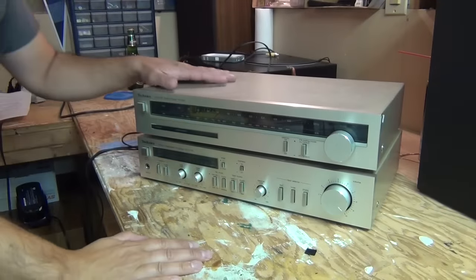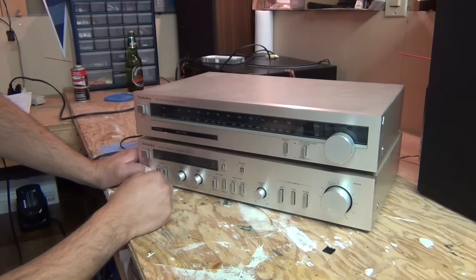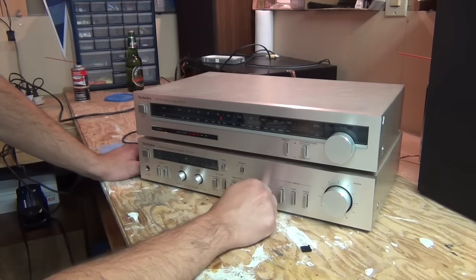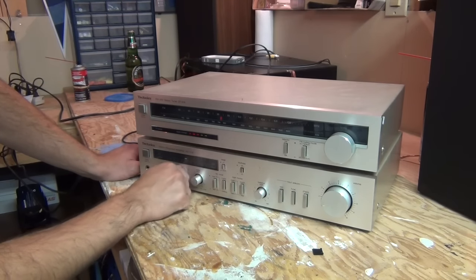I've let some time pass. Let's see what happens — I've reassembled the amplifier. I don't know what's going to happen, but let's press power. Hear that? Remember all the crackling before? No longer. It seems we have fixed the volume pot. We've got the balance — left channel working, right. This is completely smooth. The volume is completely smooth. Treble works fine and the bass works just fine.